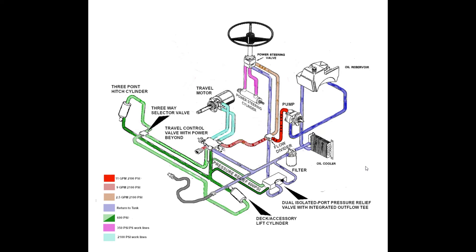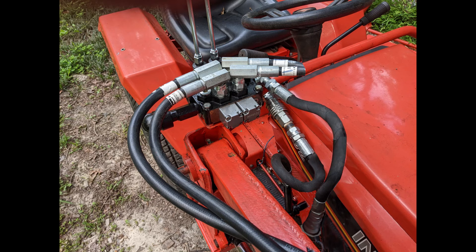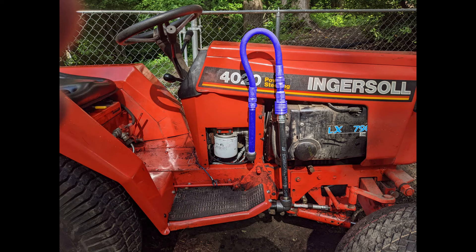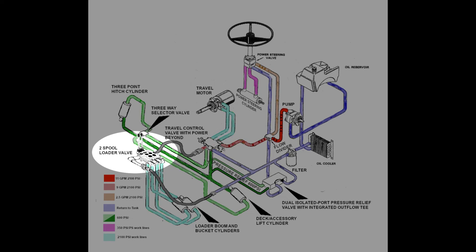This completes all the modifications to the tractor itself, so let's take a look at the loader assembly when it's attached. We bring the loader valve into the pressure stream using two hoses. We disconnect the return to tank hose from the feed line disconnect and connect it instead to the disconnect located at the loader valve's return line. Then the loader valve's feed line is connected to the tractor's feed line. The loader valve's pressure feed hose, highlighted in green, is connected to the pressure feed line disconnect, and the return to tank hose, highlighted in blue, is joined to the loader valve's return line disconnect. With both hoses in place, all the pressurized oil flow will pass through the loader valve, ready to be directed out to the loader cylinders as needed.